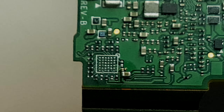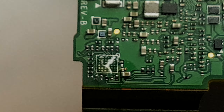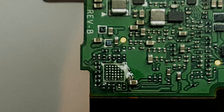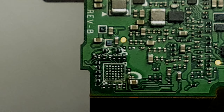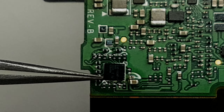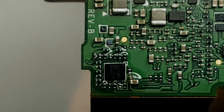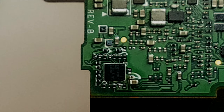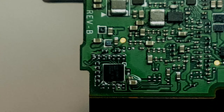Okay, so now I will apply some flux. Same procedure as before — heating up the board from a distance. And I want to heat it before I place the BGA, because the part will want to go wherever the heat is. This is why I am hitting the place before. At least in theory, the part should drop into place when it gets soldered. But hopefully I will not move it with my hot air.